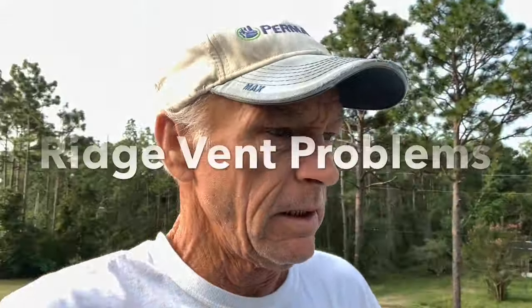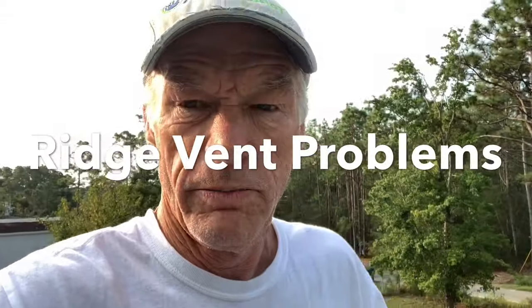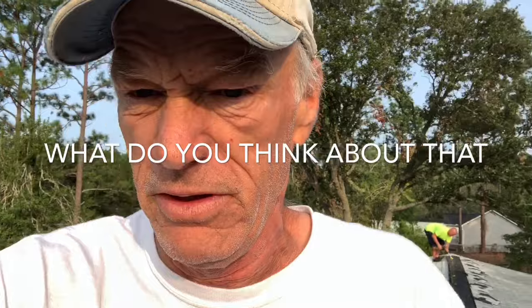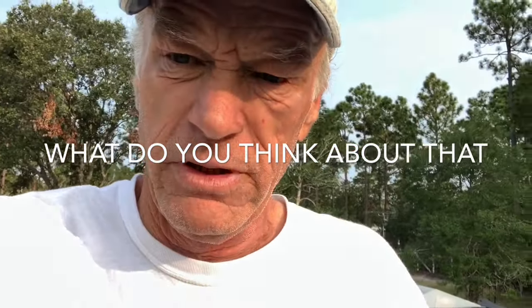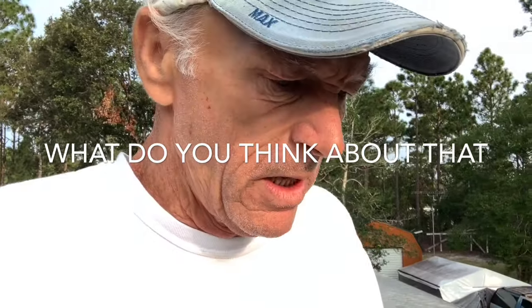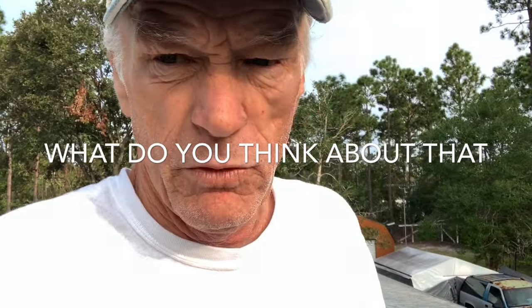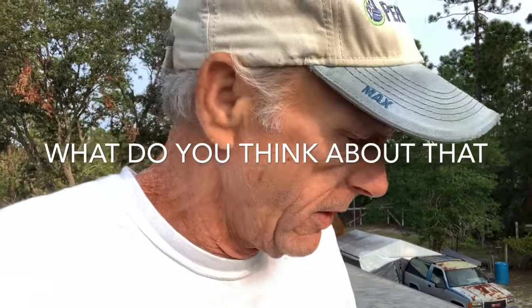Hey, I'm Drew and I'm back. We've come down to a place in Bowling Spring Lakes, where I live — not too far from my house, actually not too far from the lake. I want everybody to see this: if you're a roofer and you're nailing your shingles, you generally want to pop a line somewhere. And if you're on a double wide and you put ridge vent on it, it's probably not a good idea — if it didn't come with ridge vent, it probably doesn't need it.